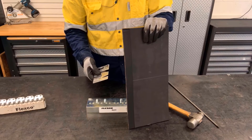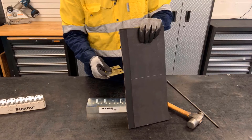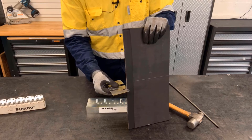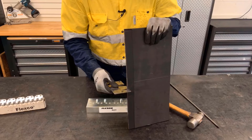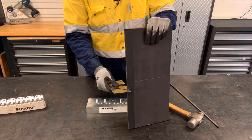The first step is to determine what rivet size to use. We're going to measure the belt thickness after it's been skived. Using our rivet selection gauge, we're going to slide it in the R2 section, and here it's showing I can use a B or an A rivet.